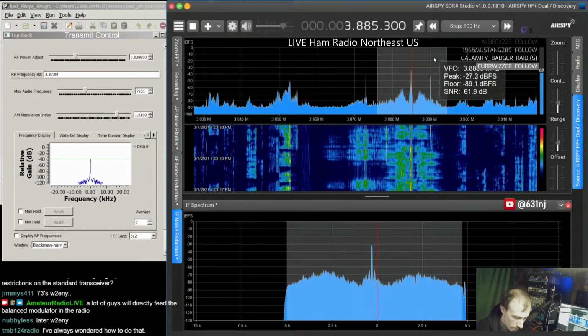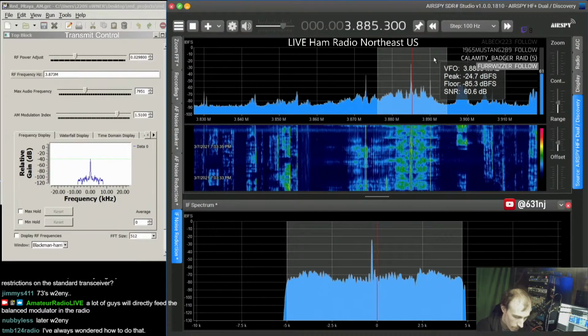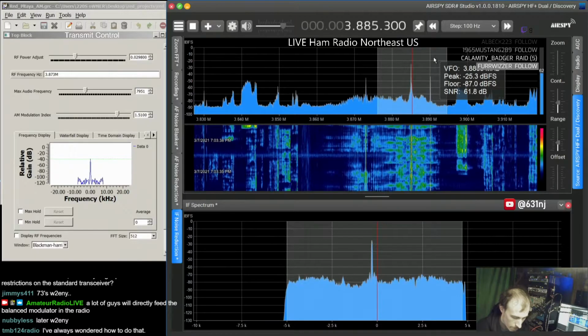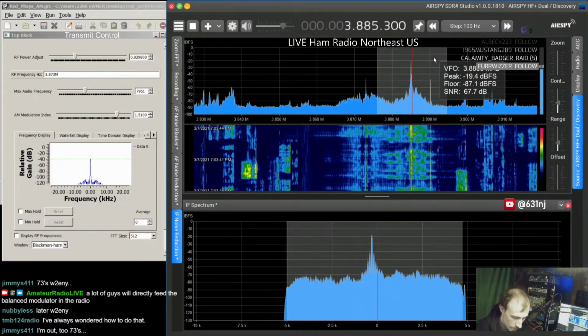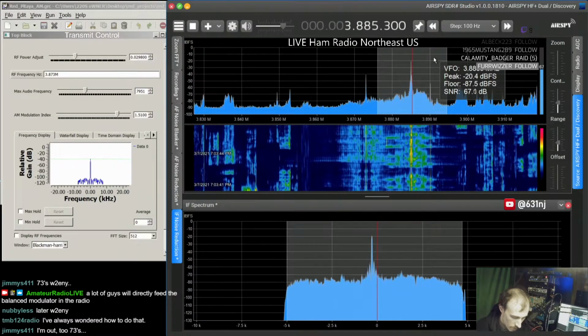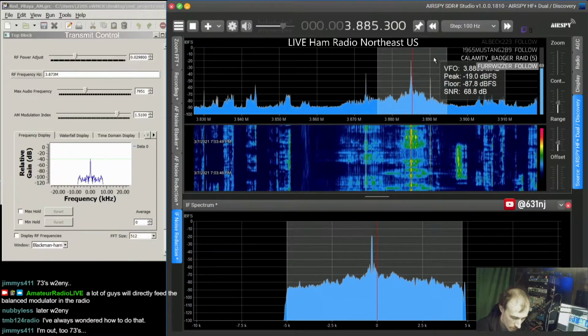And yeah, I would agree. If the previous owner put an OB2 in there, it was probably across the B+ rail that supports maybe the first local oscillator, to try to stabilize the receiver against drift. But I've got a number of receivers here.